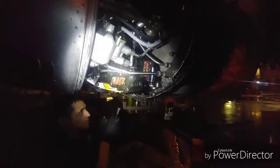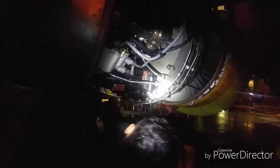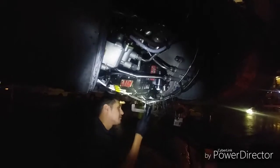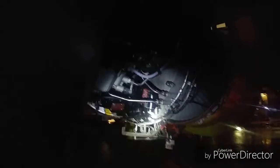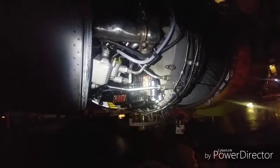Here it is — the IDG. This is what we're going to be taking off. The thing weighs about a hundred pounds, so luckily we got that jack. It's not too bad — a bunch of hoses for our oil and some cannon plugs. These two lines and this line right here — that's it. The IDG is what provides all the power for the aircraft. What makes it turn is that gearbox right there. First thing we're going to do is drain all the oil out of it and start taking out hoses and cables.